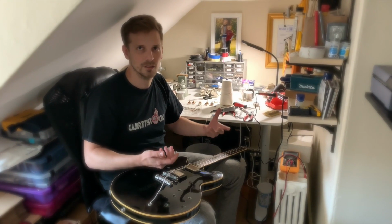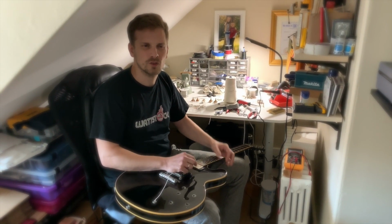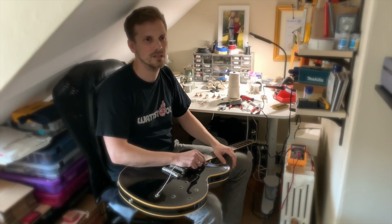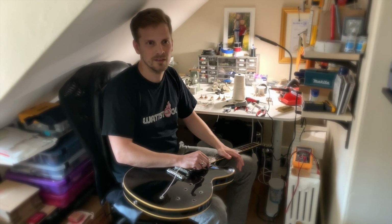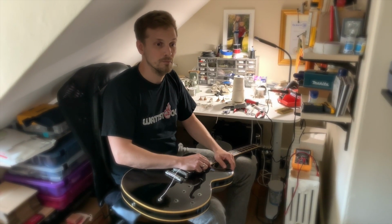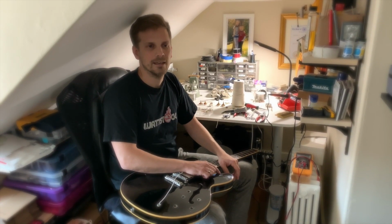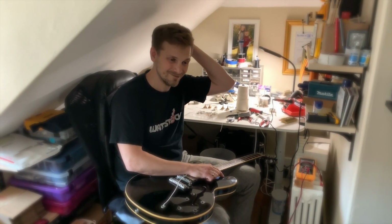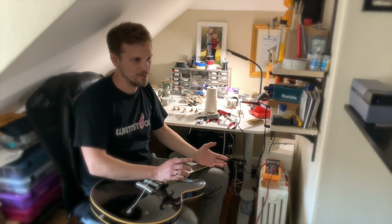It never really sounded like it, so I just decided to analyze the taper, measure the resistance, and so on and so forth, and did all that. And then I found a company that would work with me to replicate those. And after a year of R&D and lots of prototypes and sacrificing a bunch of old NOS, that hurt, NOS pots, we finally came up with the VI pots,